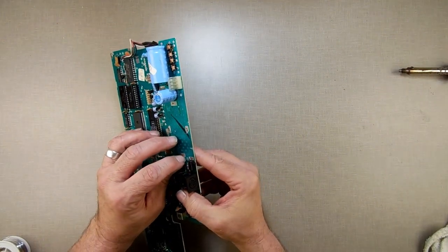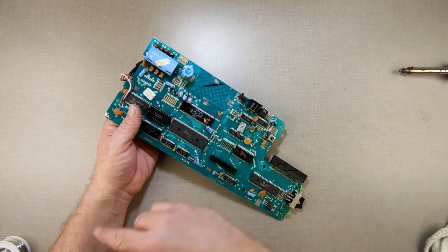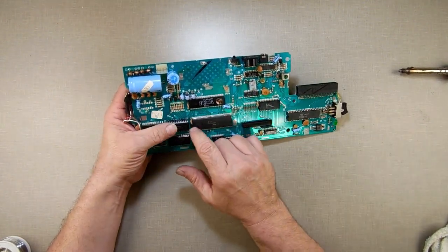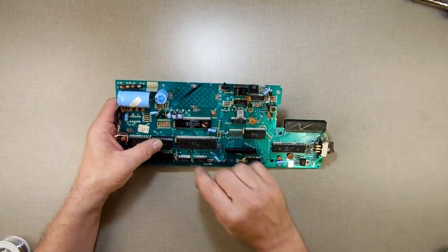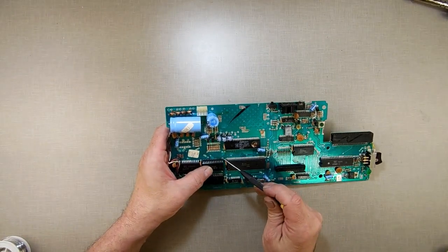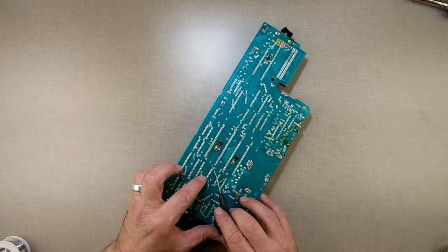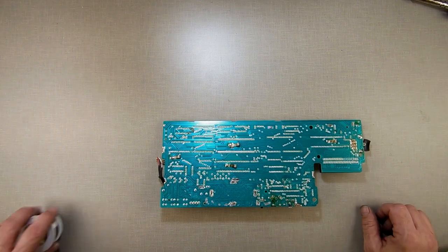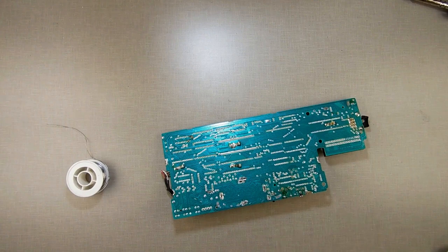This one is just sitting there. Anywho, so what I do now is, I've been watching Sean's video, and I will put a link to his video in the description too. I need 5 volts for the composite, and he recommends we use that little one right there. So what I'm going to do is turn it over. And that's this right here. I'm going to use a solder sucker. Well, I'm going to apply some solder to it first, use a solder sucker and remove it or open it up.